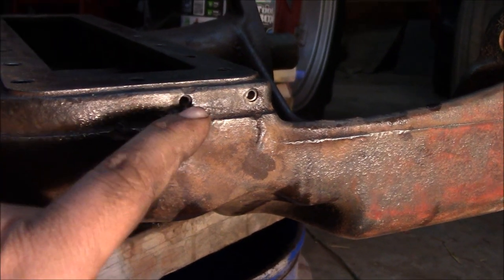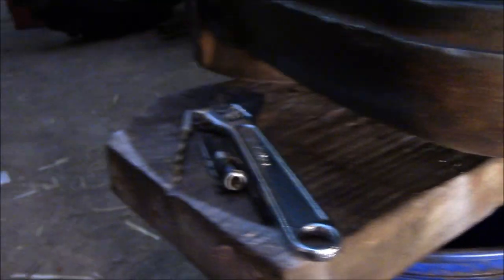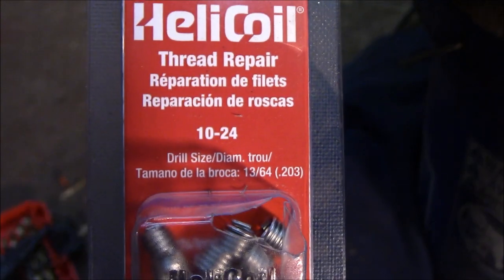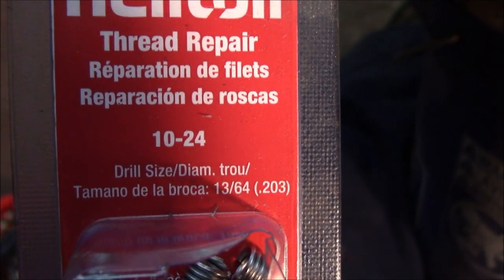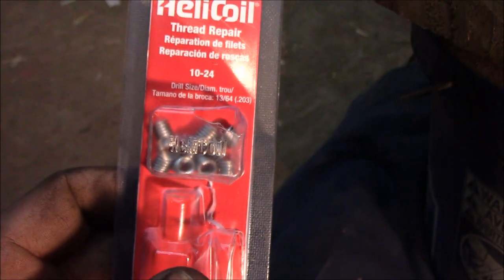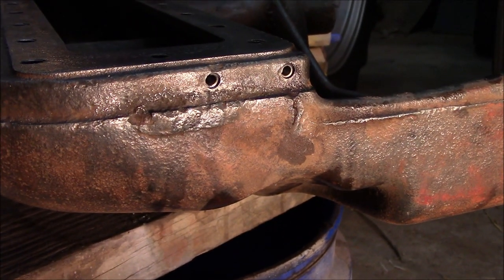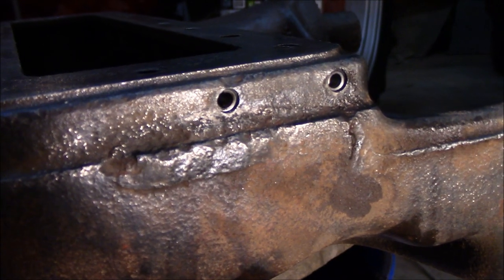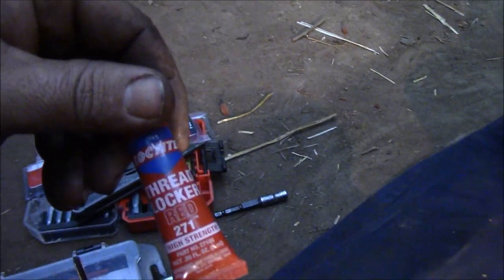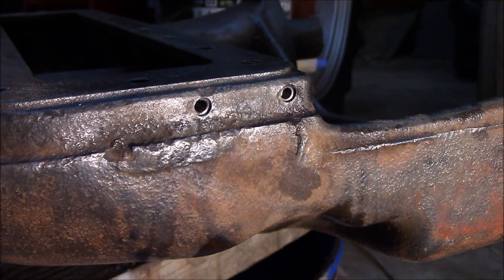That's the only way I know around it to fix that problem. So what I had to do is I had to drill it out with a 13/64 drill bit, and then come in with a helicoil set. That's a 10-24 size screw that goes in there, and it takes a 13/64 drill bit. It was ridiculous what this here cost - it was $47 just for that, and to me that was a little ridiculous since I only need four of them, but anyway I've got them if I ever have any trouble with anything else. So I drilled them out, put the helicoils in there. I put threadlocker - Loctite - in there to keep them still when you take the screw out. Hopefully you don't have to take it out.